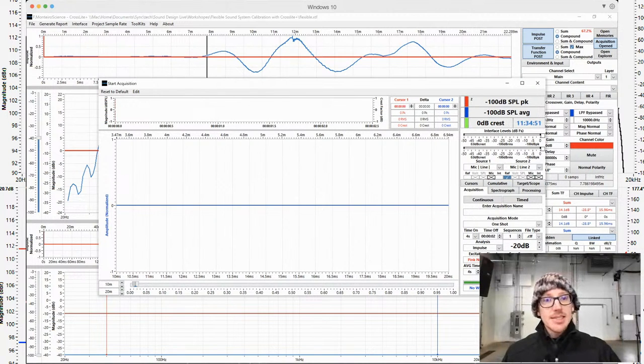So there are a lot of different excitation signals here that we can choose from. So signal generator, not just pink noise, but we have a lot of different ones. And I'm not going to explain them all today, but I have found that the option of choosing these different signal choices here really helpful in the field. There are some of these like Logchirp 3 and Logchirp DL2. I know these names probably don't make any sense to you, but these can help us get much higher coherence, especially under difficult conditions, like being outdoors with lots of wind and noise, or being indoors with lots of reflections. So these can help with that. And so I could actually demo one of those here.